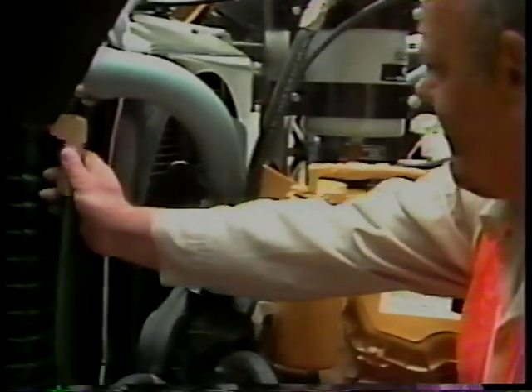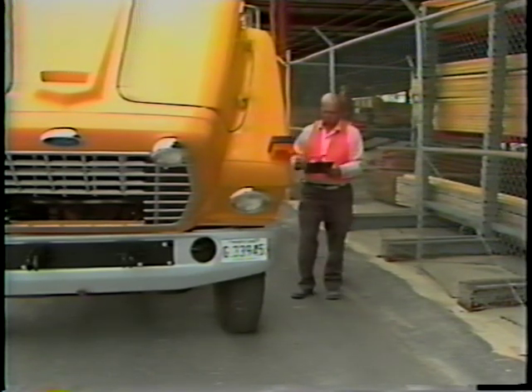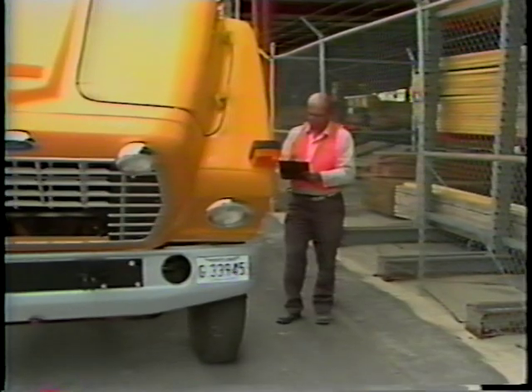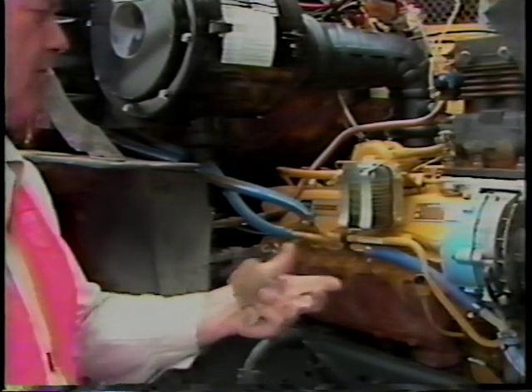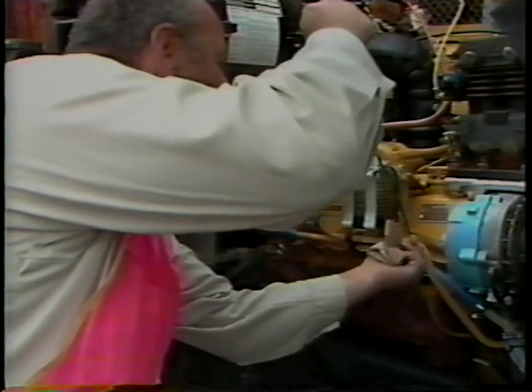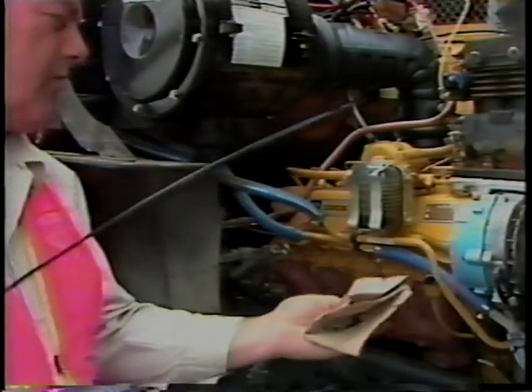Fuel and oil filter leaks are most common around the filter bowl seals or at the hose connections. Feel the bottom of the oil and fuel filter bowls for any leakage. If any leaks are found, notify your supervisor. That completes the inspection for fluid leaks, but you still need to know if the fluids are at the correct operating levels. In the engine compartment, you should check the engine oil level. The oil must be within the safe levels indicated on the dipstick. If the oil level is near or below the indicated level for safe operation, do not start the engine. Add the proper type and amount of oil until the full level is reached on the dipstick.